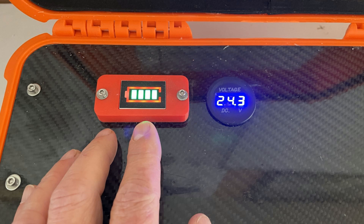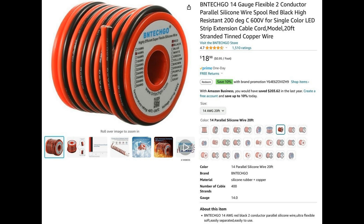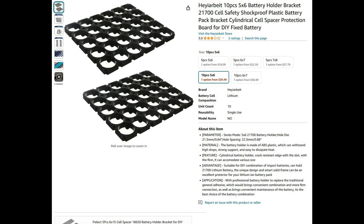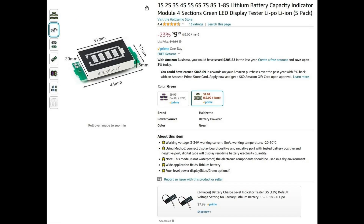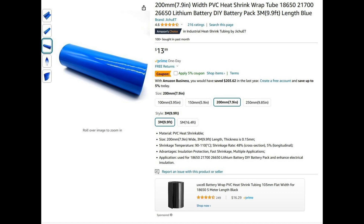This is just a really neat field power supply to run my chargers. Here are all the things I had to buy to build this. This is the little balance board that works really well. This is the Apache 3800 knockoff Pelican case from Harbor Freight for $39. These are the battery holders made for the 6S 5P configuration. Here are some specs on the battery — the cells are about $5 each when you buy 130. This is what I call the ladder strips for attaching the batteries in parallel, and this is the little voltage tester. These are the insulators you need for the end of the cells, and I needed some shrink wrap for my battery bricks.